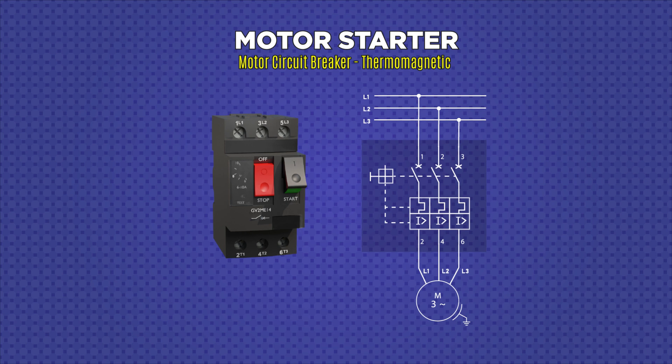When the motor starter trips or the power supply is cut off due to some fault, it will not resume automatically but must be put back into service by pressing the start button manually. Also, a motor starter does not replace a thermal sensor if you need to know the engine temperature, since the motor heats up when there is an overload and that overload demands more current.